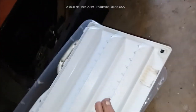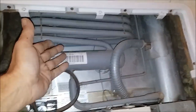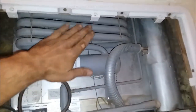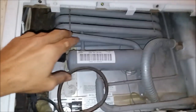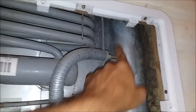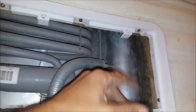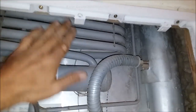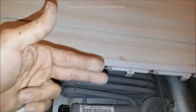Never cover the entire intake flow to the refrigerator — ever — because it will overheat. These are thermostatically controlled so they won't technically overheat, but they will create more scouring effect because it'll overspeed the gas. That's an absorption refrigerator issue: if the heating element behind here doesn't have the ability to shut off, it will overheat, overspeed, and scour holes in your cooling range — the recombiner area at the top of the refrigerator.